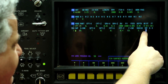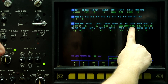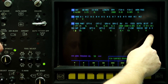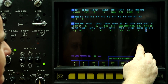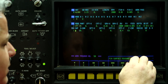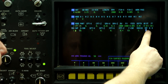I'm going to leave the surface roughness at zero so it roughs and finishes the geometry at 5 thousandths feed rate. I do not want to put a number seven in here because that will run the feed rate really fast because of how large the radius is on the tool. So when you're doing really big radiuses, just leave this area blank on the older control. I cannot specify a feed rate on a finish pass like I can on the newer machines.